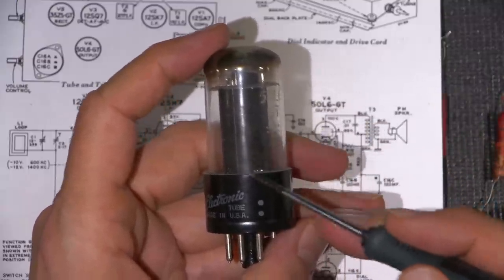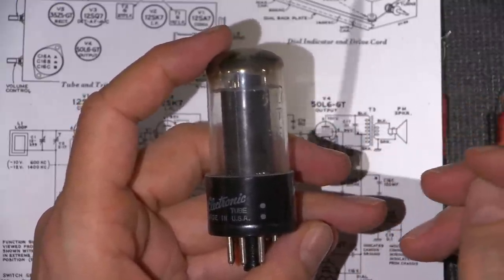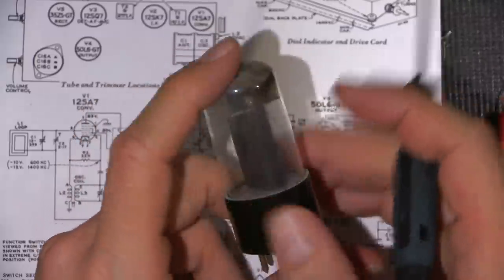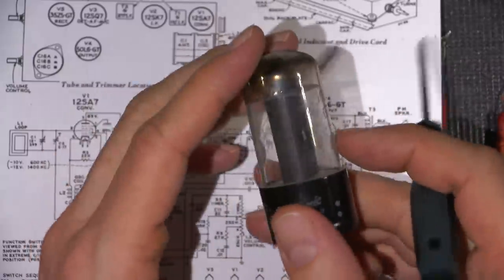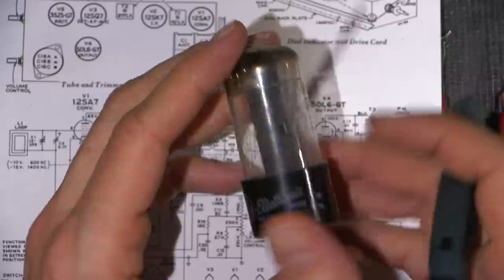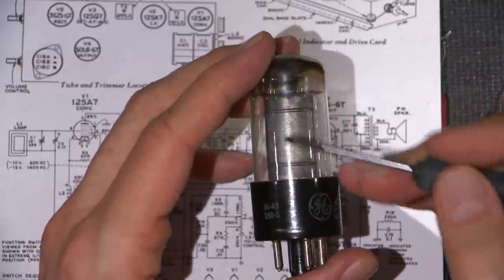The actual plate is starting to glow red. Now, granted, a lot of vacuum tubes, when the plate does have just a very slight cherry spot on it, they sure seem to sound nice, but it's very hard on the device, all right? So you want to stay away from glowing plates.